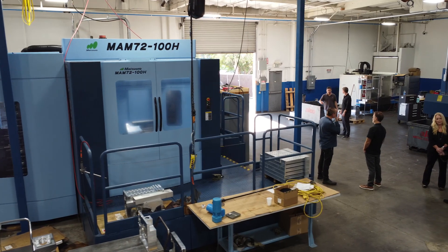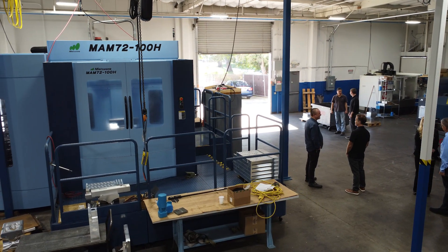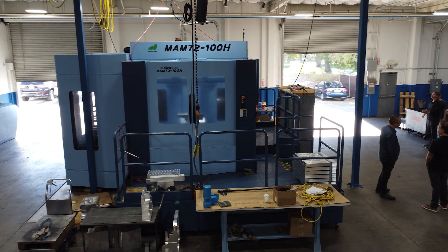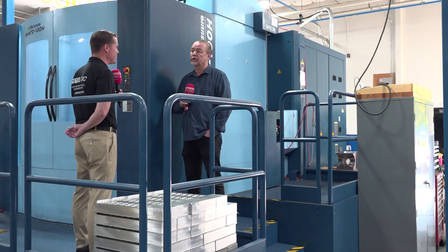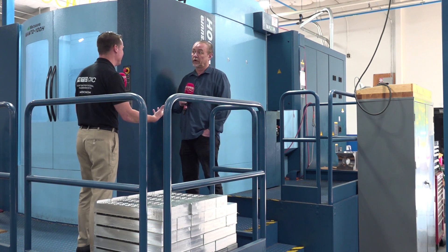A lot of people are trying to make regular machining centers into automated machining centers. It can be done, of course, but it's a challenge. They don't hold enough fluid, they don't have the temperature sensors in the castings. It's nice to have a machine that's really built to run 24 hours. That's very, very well said, Richard. And I guess that's what you get when they're the first in the industry to think of this concept and implement it.